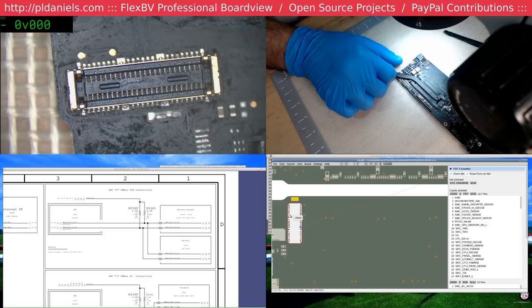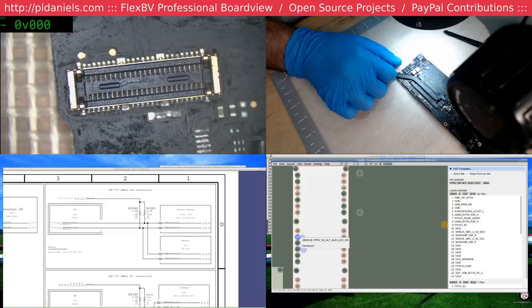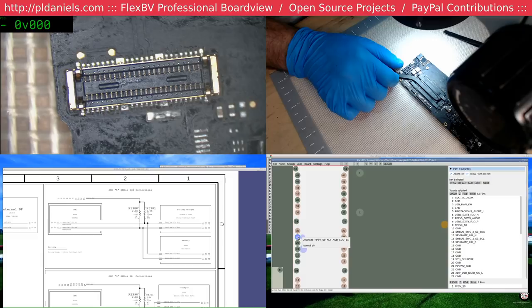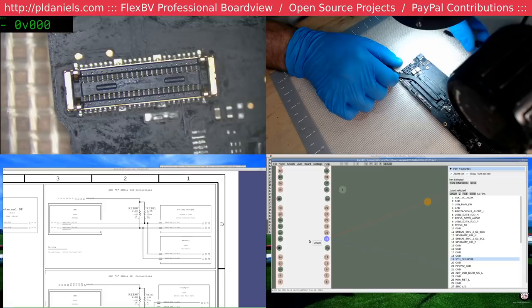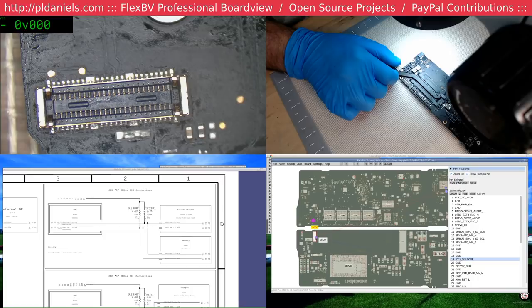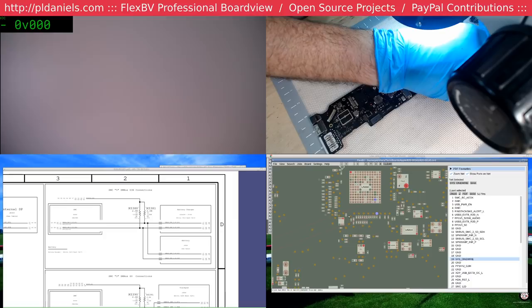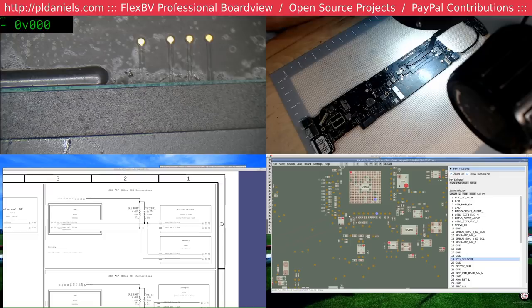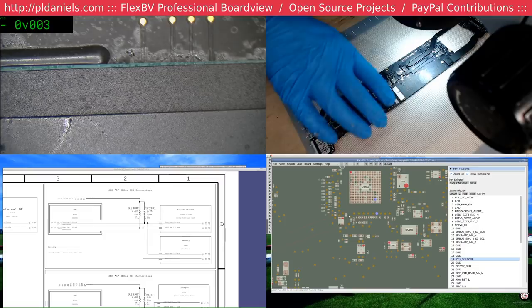Okay. What side of the ground? 1, 2, 1, 2. P5V, SO, alternate, nah, that's not it. Where is the SysOne wire on this? SysOne wire is the first after the so it's this one here. So we'll check continuity between that. Oh damn it, it's on the other side of the board. Oh, that's just glorious. We'll see if this one wire's coming up. Unfortunately, we can't really test it on the connector so well because it's under the flex and it has a very short little bump out before it goes straight off to the SMC. Oops.